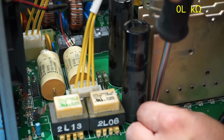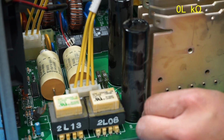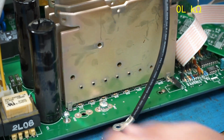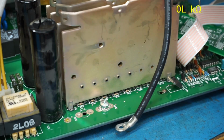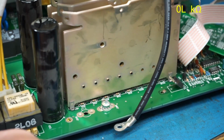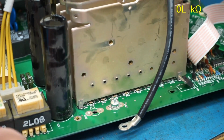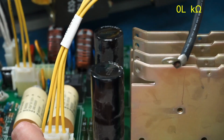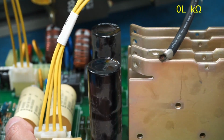So there's a screw right here that I said. Looks like that might release the board and allow it to slide forward because it's mounted on these little tabs right here that fit into these grooves. So let's see if that does it, because I can't see any other screws from where I'm sitting. So, no, there it goes. Look, it's loose. Cool. So that just lifts up like that. Looks like I can just bring it forward. And I have one more connector to undo back here. There we go.